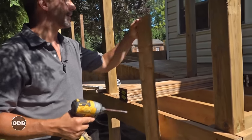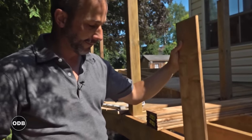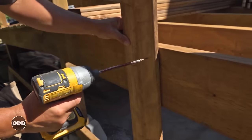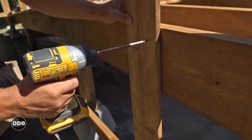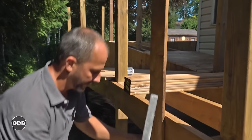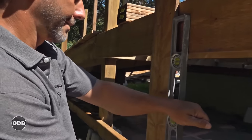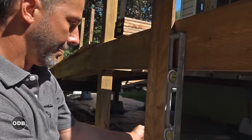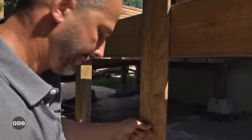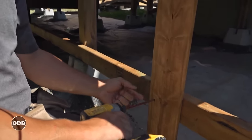I'm using a fence board — it's very skinny, five-eighths by five-and-a-half, called a one-by-six — basically just for creating privacy on a fence. I'm about an inch down and an inch in on my line, then drive that inch-and-a-quarter screw. Now take your level — here's the important part of doing skirt board. People can tell from a mile away if it's level or not, so we make it level, then throw a screw down here, inch over and an inch up.